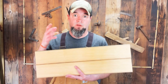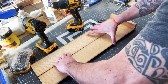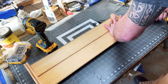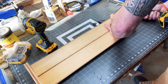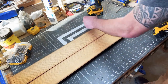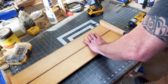We're going to use a couple of scrap pieces of material to put on the ends of the material you're going to be joining. As you can see, I have about an eighth of an inch — maybe a sixteenth — of a gap there between the two. Make sure that the scrap material you're using is not as wide as the two boards put together, as you need something flush to ride the fence of the table saw. I'm using one-inch screws.